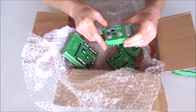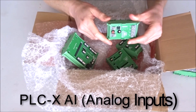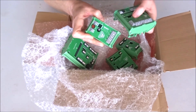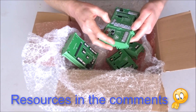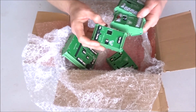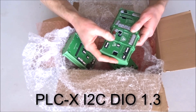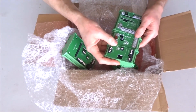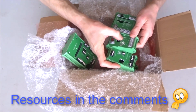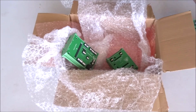This appears to be a standalone PLC controller of some type. I'll have to study it. Actually I believe this one is an I2C PLC extender. So you can have a master controller, and the master controller has I2C here, and you can hook the I2C between this and this extender. This is also an I2C extender. So here we have a master controller and I2C extenders for the master controller, and you can daisy chain a number of them as long as you set them on different addresses. Here is a table of addresses and also some address selection. So we've figured these guys out.